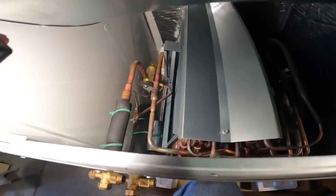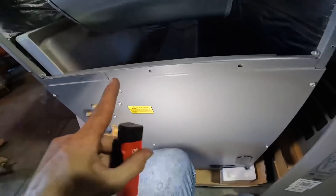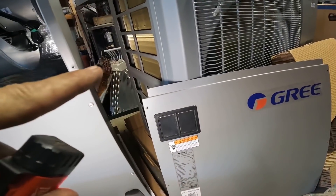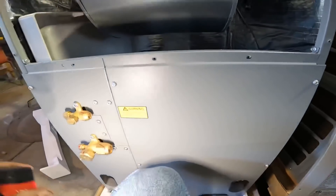Basically there are no sensors on this coil, and all it needs is a TXV — a regular TXV. You can put any air handler on this condenser as long as it has a TXV, same thing with the case coil.